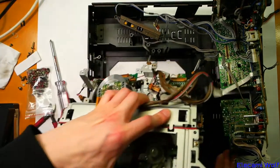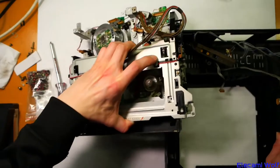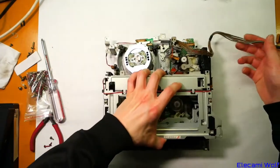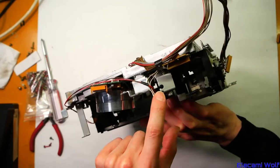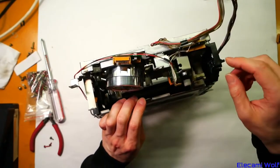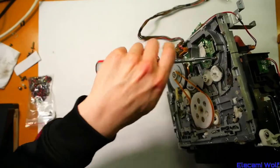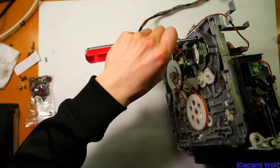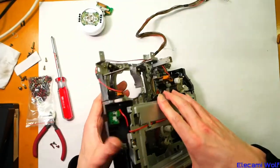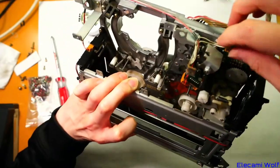We still have an undone back grounding wire — we'll have to undo that. Okay, we're going to put this aside and get the head out of this. So this is working electronics, we'll keep that. Now I've got to borrow the head from this mechanism. The audio cables were going through that thing there, which was quite difficult to undo because they're quite thick shielded cables. Salvage ahead. There's quite a lot of wires that go to this board — five of them go onto the mode switch.